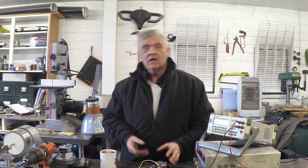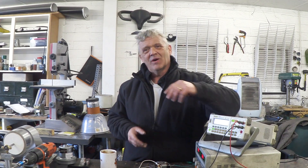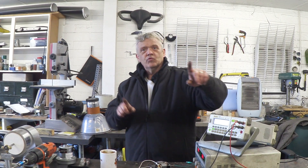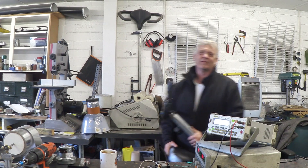We need to get gearing in there so that when we give it a spin we can get it spinning quickly. One thing about these motors incidentally is they are self-exciting. If they're not, you stick a magnet on there or put a separate current down the field windings to get them going, but they're self-exciting with the residual magnetism already in there. Even so, if you can't spin it fast, you're not going to get anything out - we need some gearing.